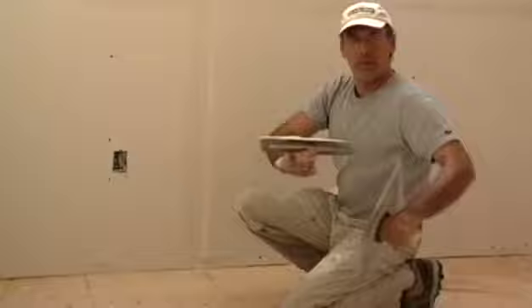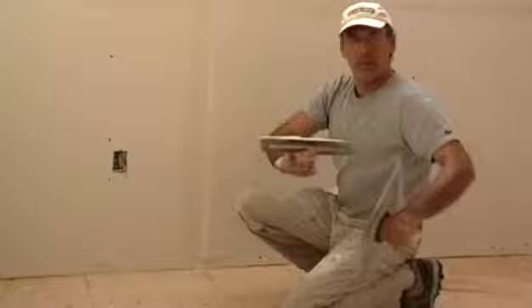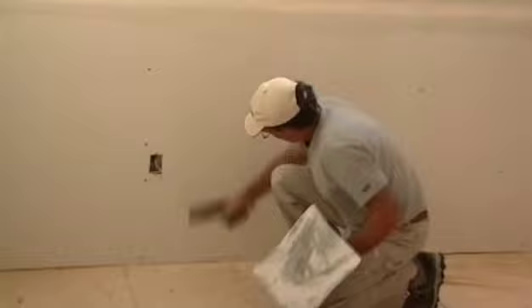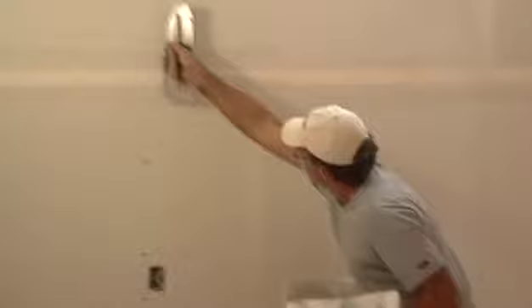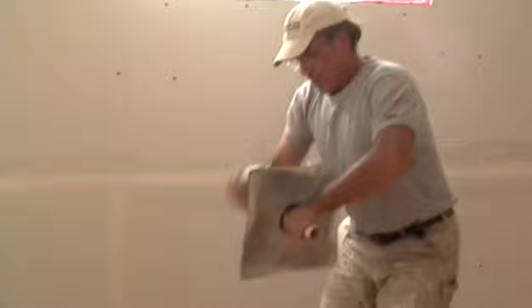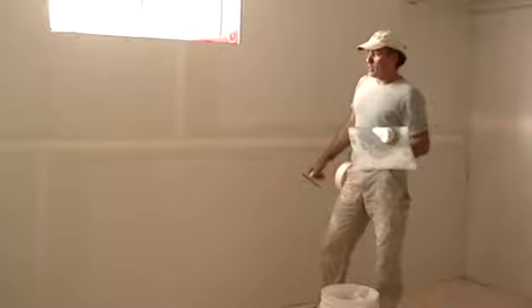We might as well go down and take care of this mud joint. On moving the mud, I go twice to fill up the whole trowel - I pick it up twice for mud control. And we lay it on. I'll borrow some mud; there's a couple of screws in here so I just went and coated them. Skin against the board on the tip of the trowel, and tilt it for the whole thing to come up. Don't like the way that looks? Just flatten it a little bit. There's an intersection that'll be coated many times in the next two coats. That's how the tape goes on butt joints and tapered joints.